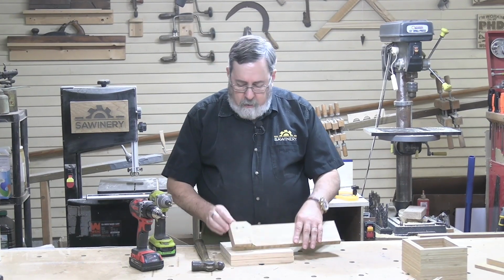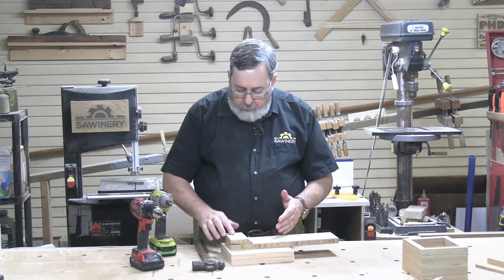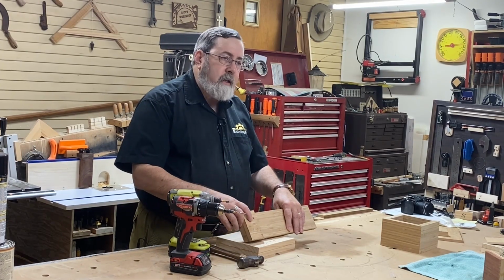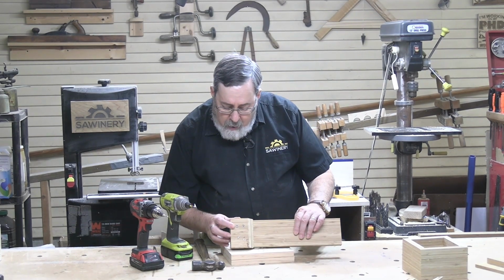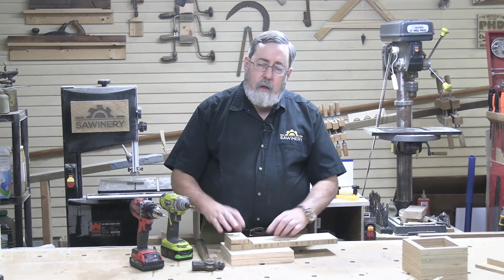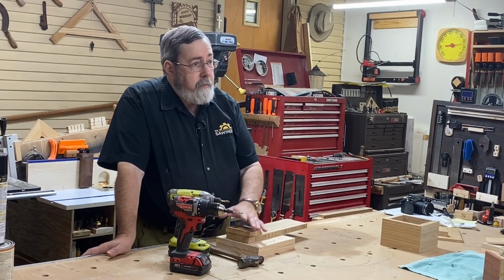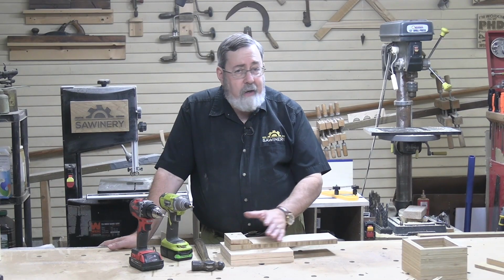Okay, I got a lot more resistance to the screw going in out of this plywood than I would have, say, with regular softwood plywood. That screw is actually hot from the friction. As you could hear, the impact driver was really working to get it in. I did get it all the way down, but I did not get the bugle head flush. It's actually sitting up about 1/16 of an inch. So the surface of this wood is considerably harder than what you would find if you were using regular softwood plywood. And I would say probably the same if you were comparing this to hardwood plywood, because really hardwood plywood is softwood plywood with a hardwood veneer on it, or any of the other engineered woods we use.